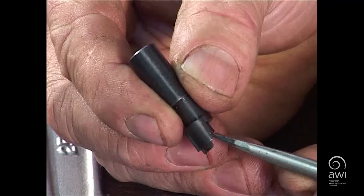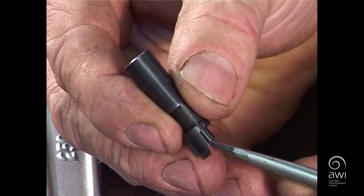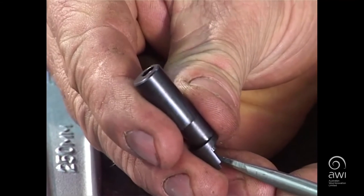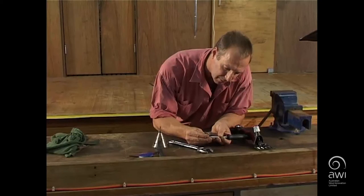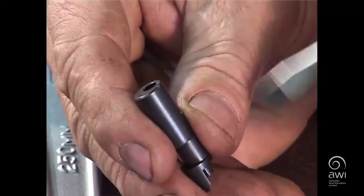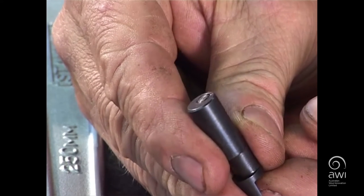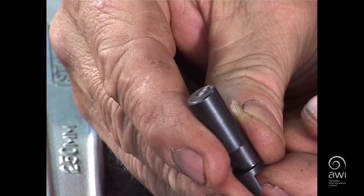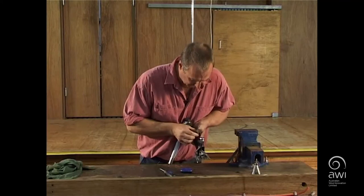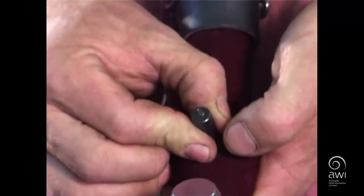And as you can see, it moves up and down. And what we're looking to do is to be able to get that ball pushed up so it's sitting flush up here with the top of the post gauge. So it needs to come flush like that. And that should be our correct setting, which that is sitting pretty much right. So there's no adjustment to be done there.